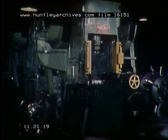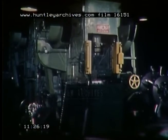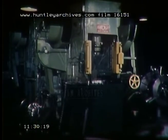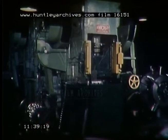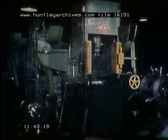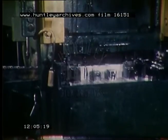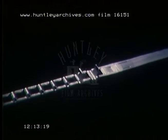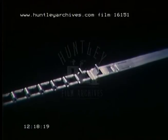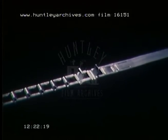This model 630 single crank straight side press is one of a battery of Chicago presses used to produce all sizes of agricultural chain. The product being manufactured is their number 62P detachable link chain. The coil stock is one and nine-sixteenths inches wide and five thirty-seconds inches thick, special 1030 carbon steel. From the reel, the stock passes through a roll straightener and is automatically fed to the five-step die, where the center is lanced and the lance is rolled back to form the barrel around the pin end of the next link. Here are the operations in the five-step progressive die: scoring, lancing, forming, and swedging, cut off, and curling.